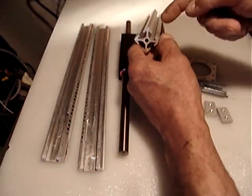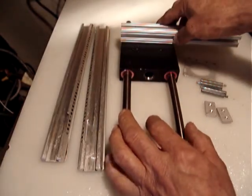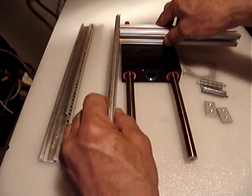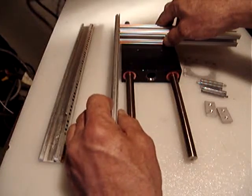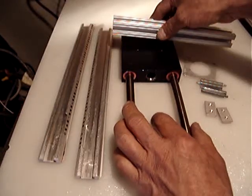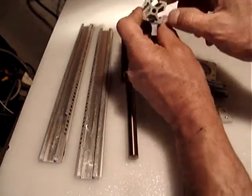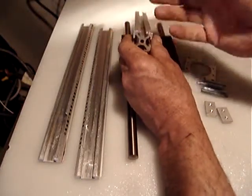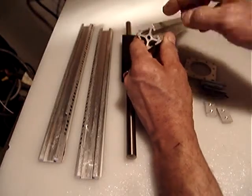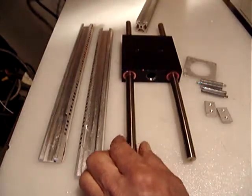the first thing you need to make is a hole wherever you want it. You have to leave a little room for the sides to not interfere with the block. You can mount it in the center. For this part, you can use your drill press to drill a hole first, 1/4 inch perhaps, and then an end mill for, this is 1/2 inch I believe.